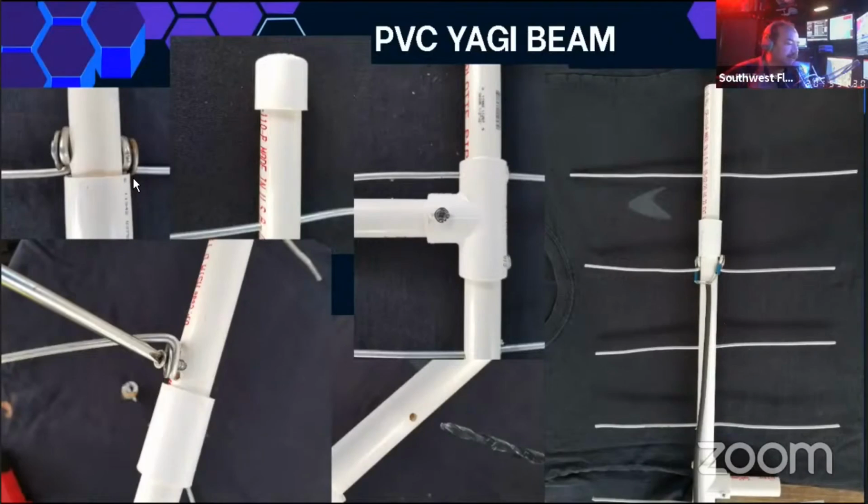Again, this can be soldered or solderless. You can put little horseshoe connectors on the end of your wires and stick them right down in there and screw it down. Where solder gives you an advantage is with weather. If you're going to put this outside, you're going to have to silicone it really good where all your connections are. And if they were soldered, that would help as well, because it's a lot harder for weather to get between solder joints than it is for weather to get between pressure joints that are just under a bolt or whatever. So you just got to keep that in mind.